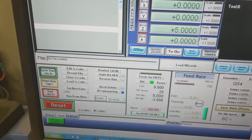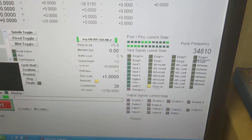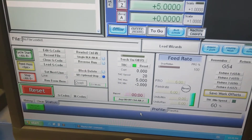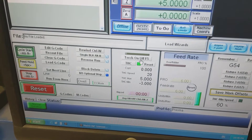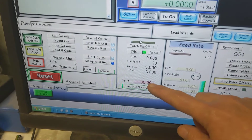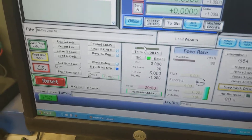Looking at the diagnostics page now, the Proma is still in test mode — you can see torch on, torch up, and torch down signals coming through. This takes control of my Z-axis. I've got the maximum height set to 5mm and the minimum height set to 3mm, so it'll only toggle between 5 and 3 on this job. My table is within 3 millimeters so I probably won't need to go lower than that anyway.